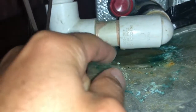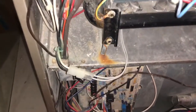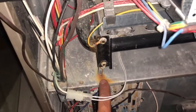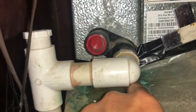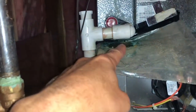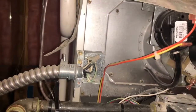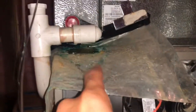Also, when you're near your furnace — this is something I'll throw in — there's condensation that drips here. I sealed it every way I could and it still drips, so what I came up with is a little plastic tarp so the water drips over the edge. This is a very common thing where water gets on the motherboard and fries it. Mine previously fried because of that. The previous technician left a magnet here, so I put the magnet on this little tarp so the water now drips away safely. I replaced all the pipes and it still dripped — there might be a crack deep inside — but this easy fix works.